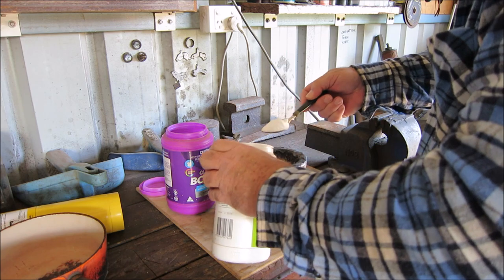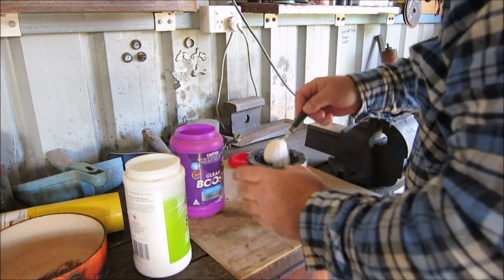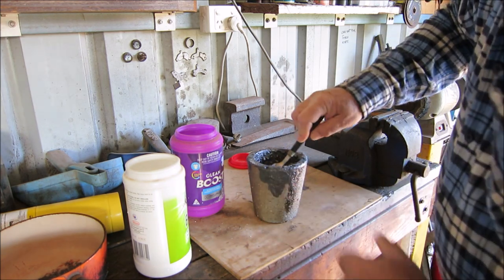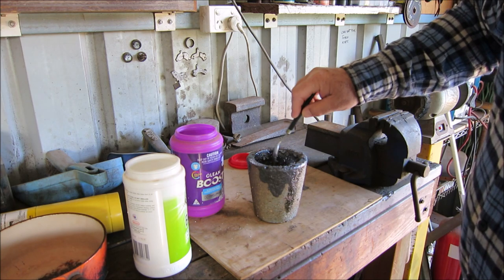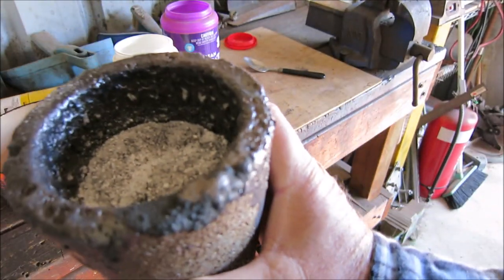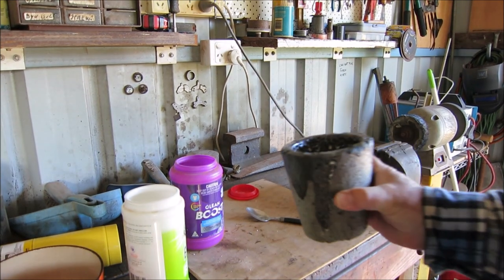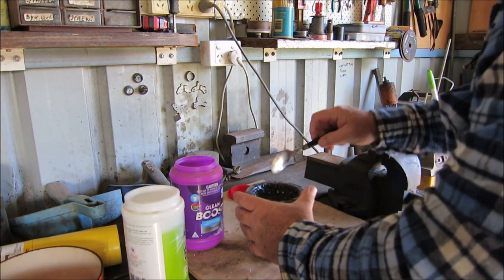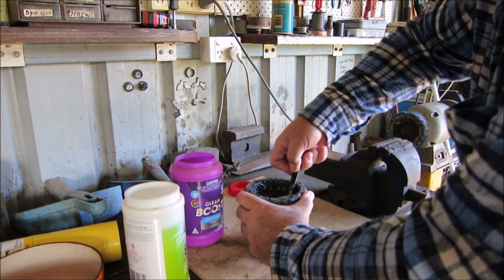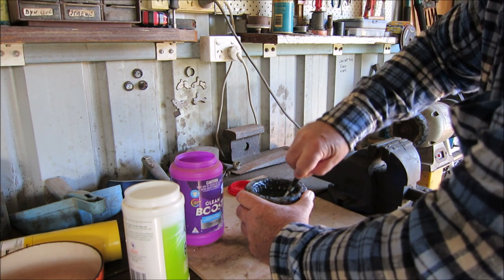Give it an extra one of borax. Like I said, you can't put in too much borax. And also, like I said before, don't overfill your crucible. Just three quarters. I'll just show you this. Crucible, just three quarters. That's all you need. Otherwise, it will tend to bubble over. It'll bubble up and boil over if you put too much material into the crucible. So don't fill it right up.